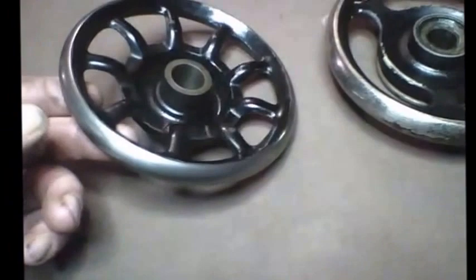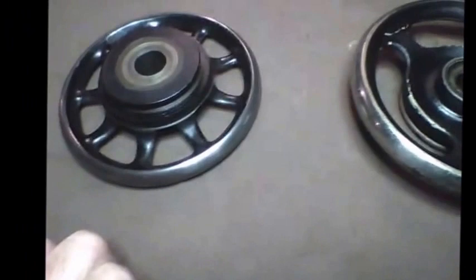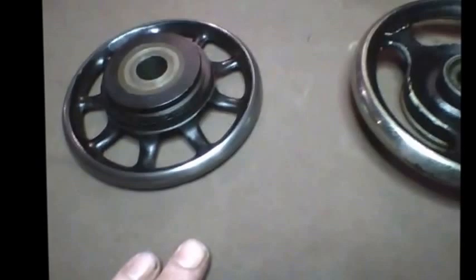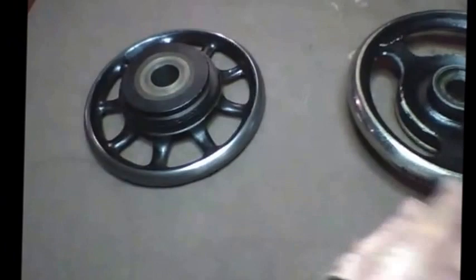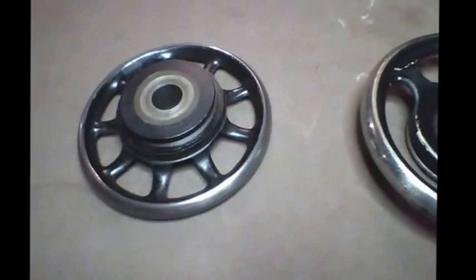As long as you're driving off the belt and spinning this wheel, do what I described in the first part of the video: take the 100 grit — or even 36 grit, whatever it takes to cut this metal down and get rid of the pits. Then work up to the 600, the 1000, and the 1500 grit. The polishing wax stick I used is available at Ace Hardware, Lowe's, places like that. Add a piece of leather and you're set to go.